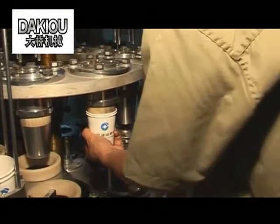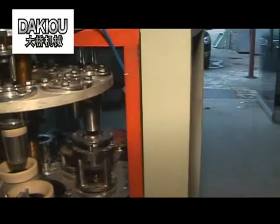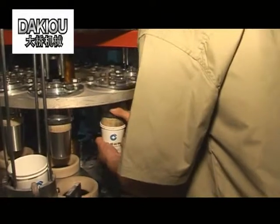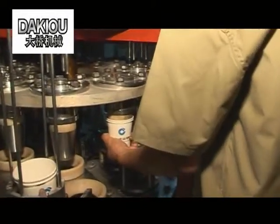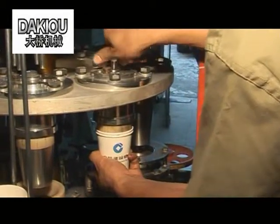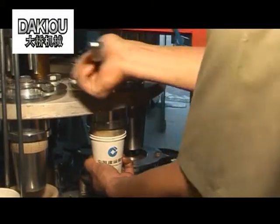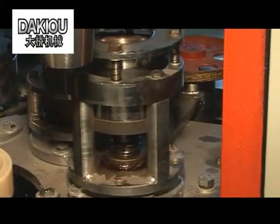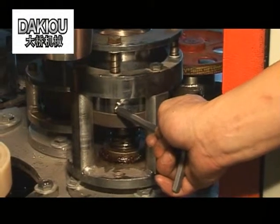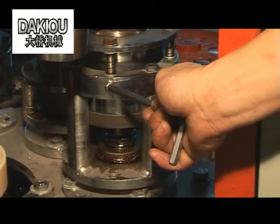Loosen the 8 central bolts for connecting the flange on the large wheel and change the 8 groups of forming die. 9. Install the new flanged lower die, upper cover, flanged panel, and four spring column bolts.